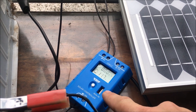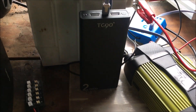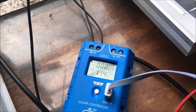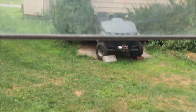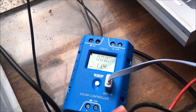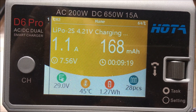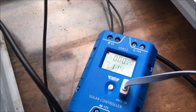I think there's a USB out here — I'm going to plug into the USB and see what kind of draw we get. Plugging a charging bank into the USB port. We've dropped down a little bit but nothing crazy. Come on sun! We're at 11.4 volts. Almost 10 minutes in, charging at 1.1 amps — the battery itself is at 7.56 volts and the system is at 11.4.